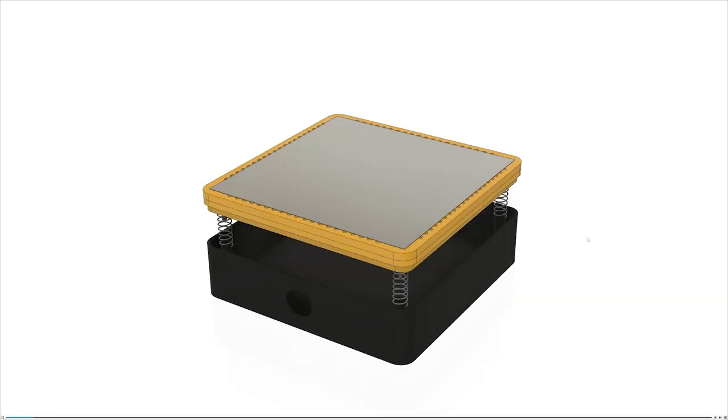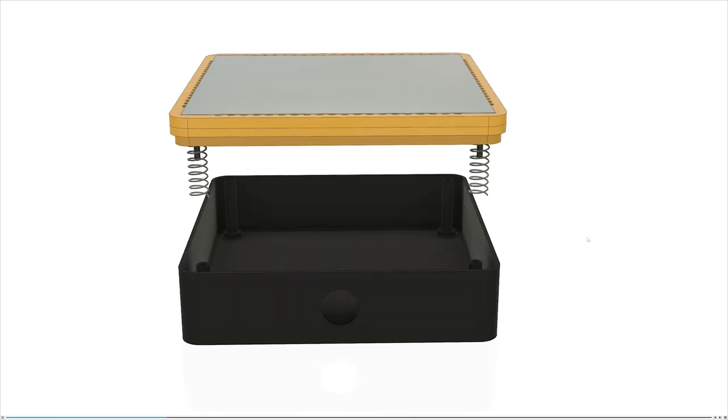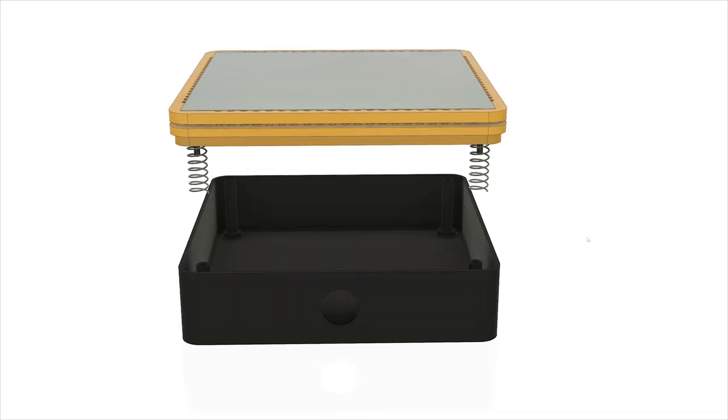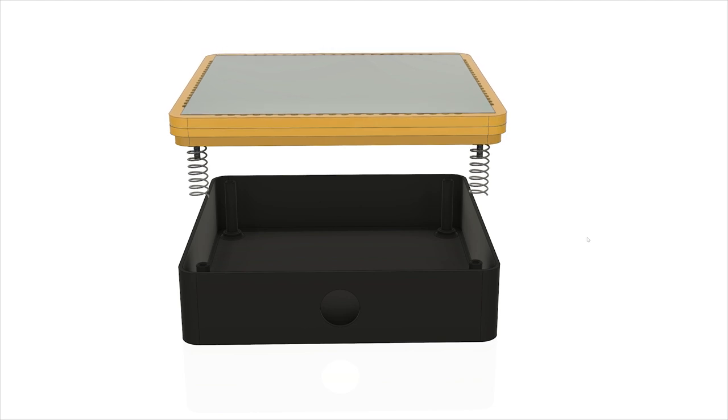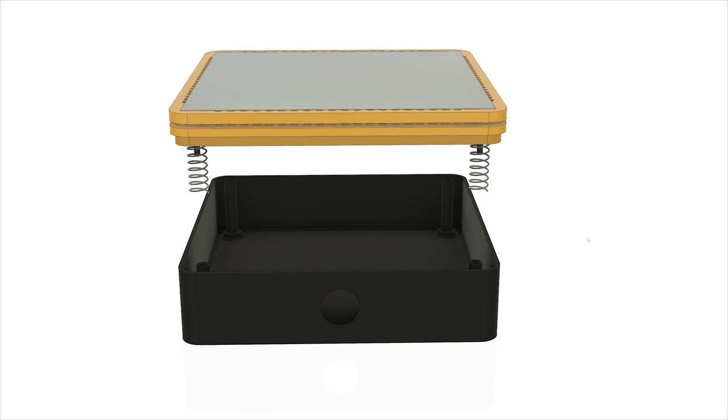Lastly, let's take a quick look at the lifting action. Here's how it looks at rest when there's no negative pressure applied by the vacuum. Once the vacuum is turned on, the stencil with the stencil lifter will go down and be flat with the PCB. And once we turn off the vacuum, the stencil lifter will go up and with it the stencil.